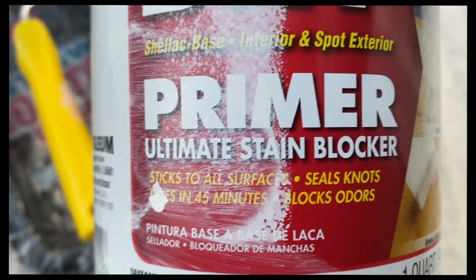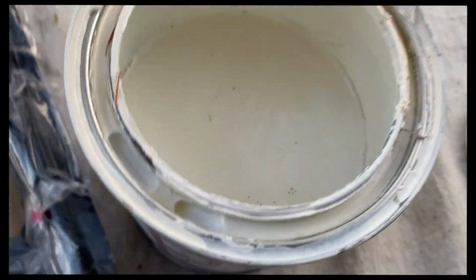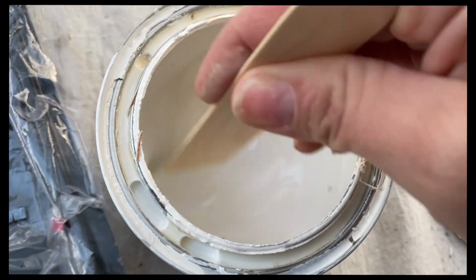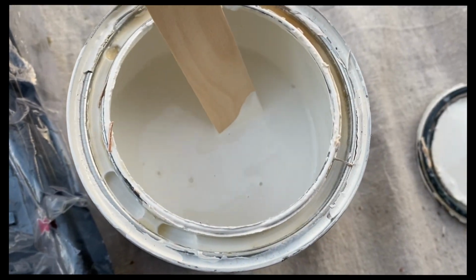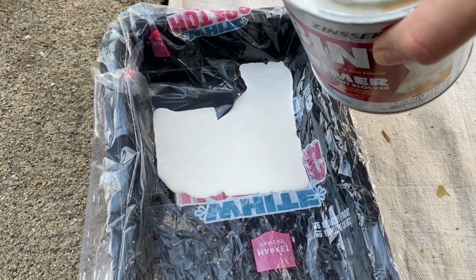I feel like there are two types of furniture refinishers. There are the ones that use a shellac-based primer on every project and just assume bleed-through is going to be an issue, and they do this as a preventative measure. It also acts as a great adhesion booster and so many more things. It's a really great product, and you can't go wrong using it on every project, that's for sure. I'm a little bit more likely to switch things up.